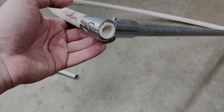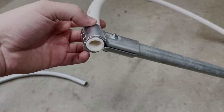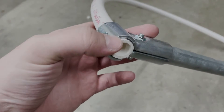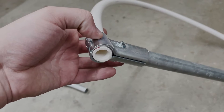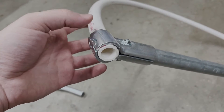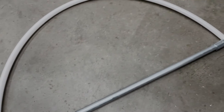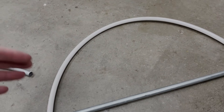So this is half-inch PVC pipe inside of our three-quarter inch EMT connectors. We've talked about doing this a lot on the channel — I'll link a couple of videos below. You do just have to shim the gap depending on the size of pipe you're putting inside the connector. Basically, this is half-inch PVC inside this connector here, and I just bent the PVC by hand over into another connector.